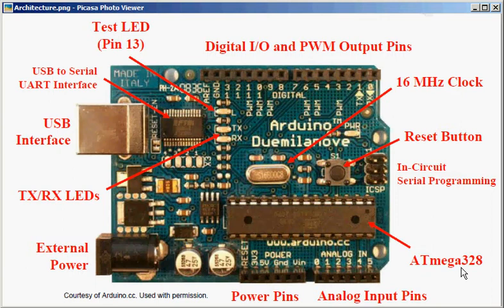After you get the new ATmega328, you can just pop the old one out with a screwdriver. But when you put the new ATmega328 in, would it start working? The answer is no — it won't start working straight away. You should actually have something called the bootloader. The bootloader is the code that should be dumped into the controller before it can be used in the Arduino environment, so you should get the bootloader into the controller.